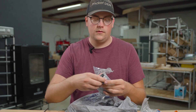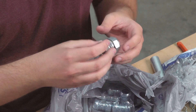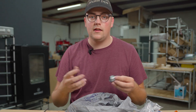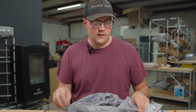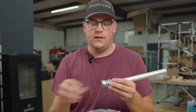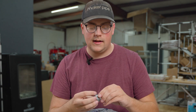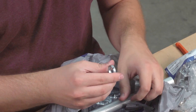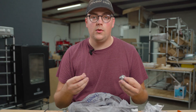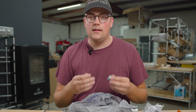This is another compression-style fitting, except this time it's a coupling. Instead of having a second side that goes into an electrical box, both sides compress down on the conduit and secure them together. As the name suggests, it's a coupling — it's meant to couple two pieces of EMT conduit. If you didn't have anything there, you'd have exposed wires between the two pieces of conduit. This basically fills that space, protects the wires, and allows you to keep the run going through it. It has a ring on the inside that compresses as you tighten it, using channel locks or vice grips. These are better suited for damp locations, but for heavy water exposure use the specific rain-tight compression coupling.